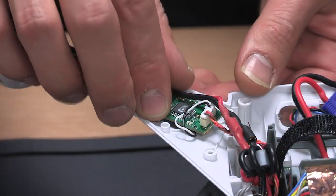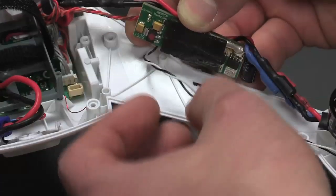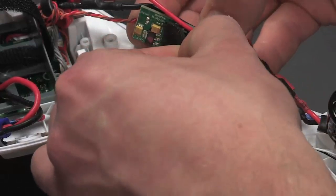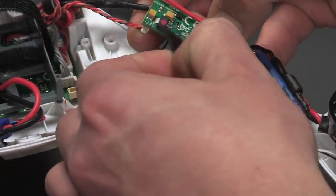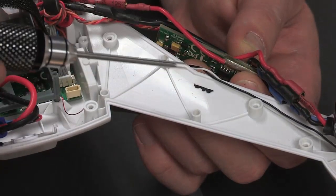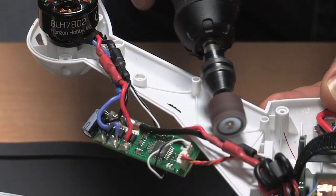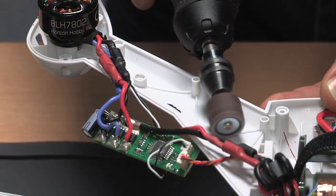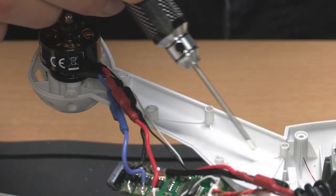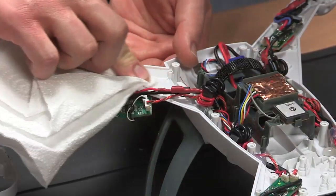In arm number 3, loosen the PC board. On the back of the board, remove the double sided adhesive tape. Grab your rotary tool and remove the fillet indicated — note that we advise you wear a dust respirator whilst you're doing this. Before you continue, make sure there are no ridges and that the area is nice and smooth. Also clean the area, removing any dust particles.